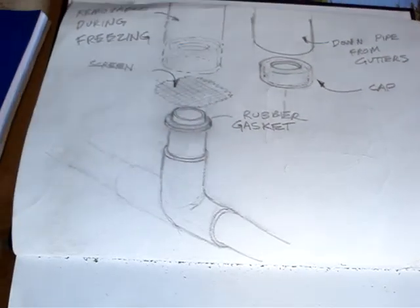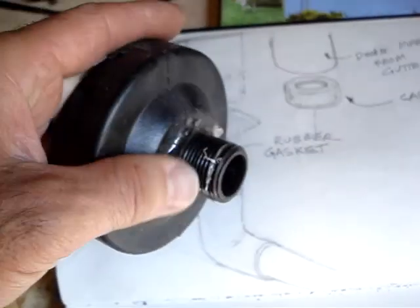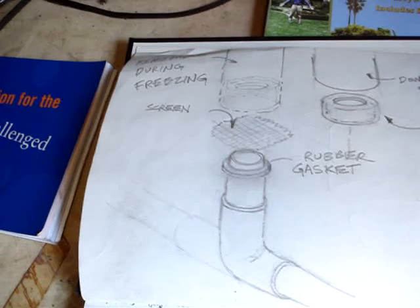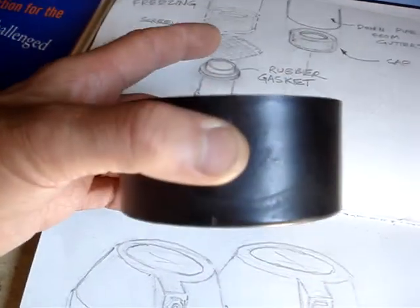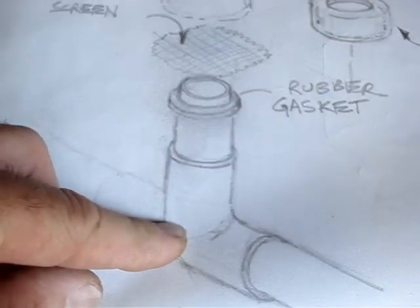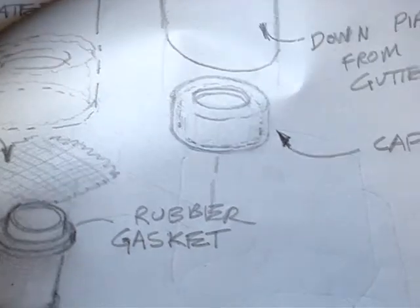So where are these downspout pipes that are on the four corners of my roof? Right now there's a garden hose on a brass fitting similar to this, which was one of my first ones – I used this small one for a toilet repair. You can see that opening is too small to allow a high volume of water to flow through during a heavy rain. So I want to use this size pipe here, with a gasket, and it will fit through the cap which rests on top of it. The weight of the pipe and the column of water inside will push it down and force it to pinch off on the gasket. I might have a screen – a regular plastic screen – between the fill pipe and the drainage pipe, and then the elbow. Then I'll have the fitting press-fit into the bottom of the catchment pipe.